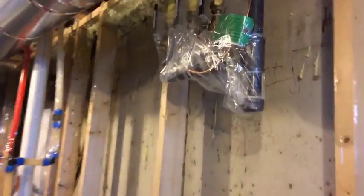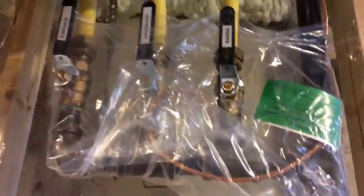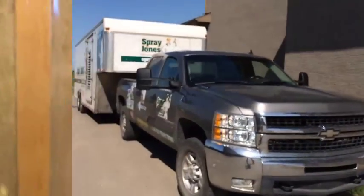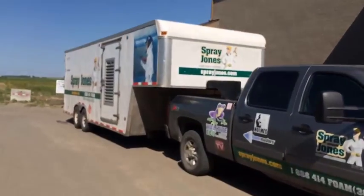We're taking a look at the tight areas — these are the areas of consideration. Are they poly? Are they masked? We tape the stud faces, we tape the water heater up, the furnace. The electrical panel needs to be protected. I have a video on how to spot a bad job where they brought the spray foam right up against the wires — we're not going to do that in this case.